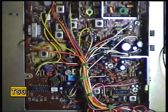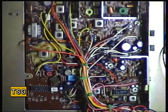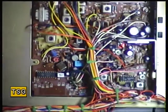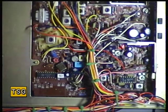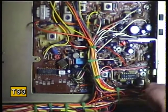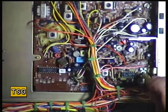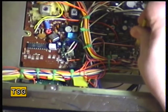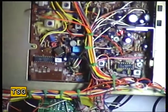Having a 100 microvolt signal on the signal generator, we'll just check that S9 on the S meter is in fact S9. It's actually plus 20, so we'll adjust that. The RX meter is RV3, and RV3 is just there. And that's bang on S9 now.